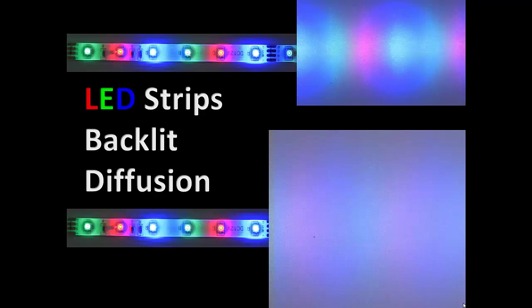Because the devices are spread out by color, we need more depth to allow each color to reach the same spot with the outside edges of the cones. This style of RGB LEDs presents a challenge for a light plane if you want a smooth, even distribution of color. Personally I would not use this type of RGB LED strip for an aperture diffusion light plane. Later in a second project I'll show you what I call white holes, where I use indirect surface diffusion and these multiple-colored LEDs blend very well. There is good use for them — just not for your aperture diffusion type light plane.